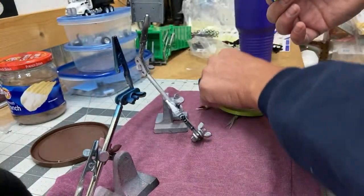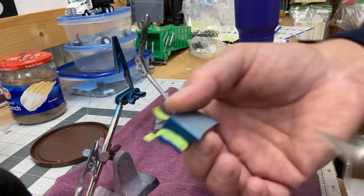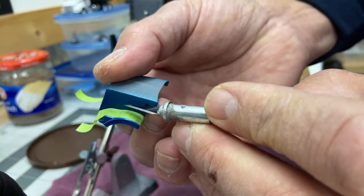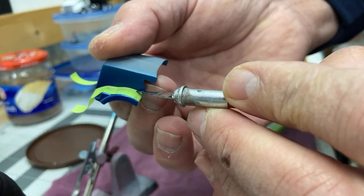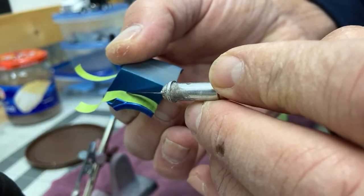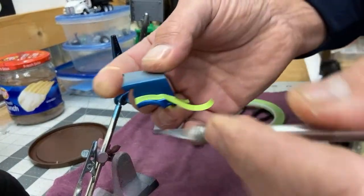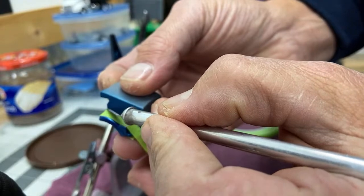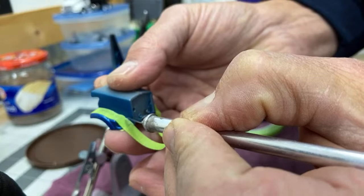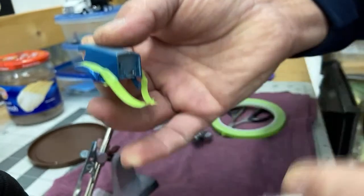Okay. If you want, come in with a knife. If you want, use the flat side so you don't scuff your paint. And then you can even kind of just gently, don't get carried away here, right? You don't have to get carried away. We don't want to scratch anything. I'm just going to kind of push that down a little bit. No worries. Don't get carried away. Don't get crazy. Just kind of give them a little squeeze. That's all. Just making sure that tape's nice and adhered against that nice, crisp, clean edge, because that's what we want.